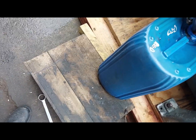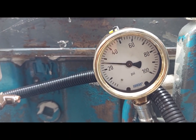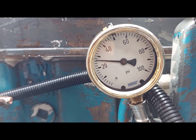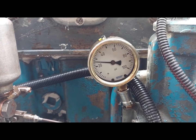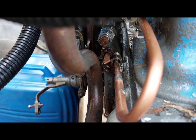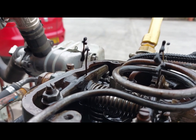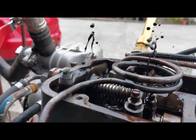So we went to start up the engine — but look what happens: very low oil pressure. It should normally be 45 psi. It's obvious that the rockers are getting too much oil; our copper pipe is just too large a diameter. And look what's happening at the rockers — oil is squirting everywhere.